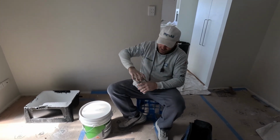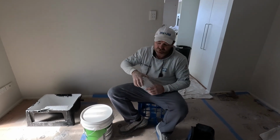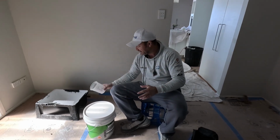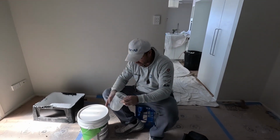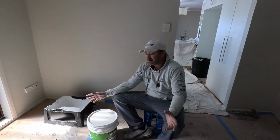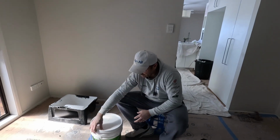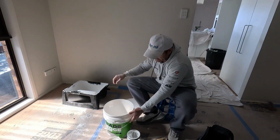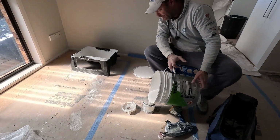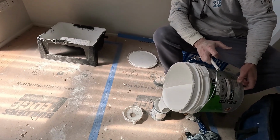What's really important as well is you want to be using wallboard sealer on your first coat. Don't go straight to ceiling paint or it could peel, because there's different things in different paints. It might look the same, it might look all white, but they are different. And a nice roller sleeve like that is going to hide any imperfections. It finishes smooth, dries smooth, but it hides imperfections. So a good undercoat is very much needed. You don't need to thin it out either, if you're wondering.